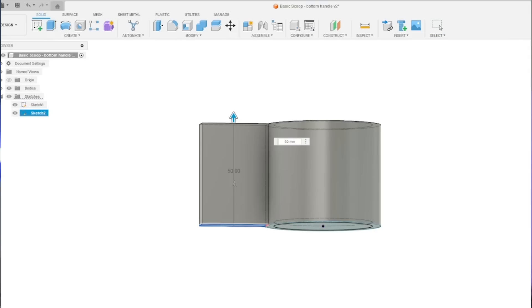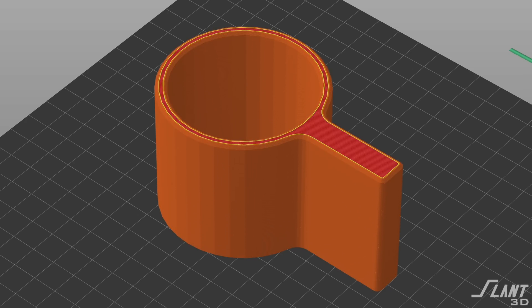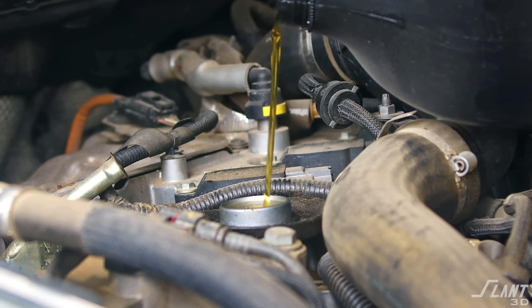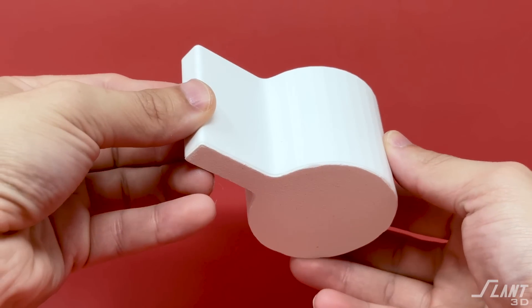If you prefer the handle on top for ergonomics, rather than having it stick out to the side, extend it upward as a slab — a flat edge along the side of the scoop. This adds minimal material and print time while giving you a large, thick, chunky gripping area. This applies to any scooping object: a ladle, an oil can, whatever it happens to be. Just make sure you're chamfering the bottom of the whole thing to keep edges clean.